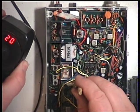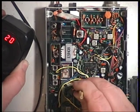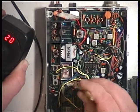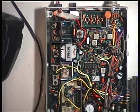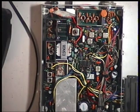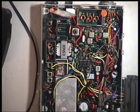Just bring that up. As I've said many times before, they drop with age. And now they're 30 years old. Some radios are on the edge of them being within tolerance, but this has gone a treat, no problem whatsoever. And then finally on transmit, because I've got no meter to set, there's the deviation to check. And the deviation is VR2.